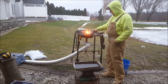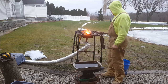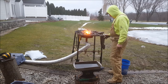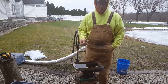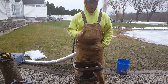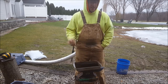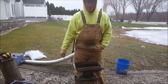I've got a magnet here on my forge — everything sticks to it. I use that magnet to check if the blade is up to critical temperature; I'll take and stick the edge on it to test. Also, I've heard from a lot of blade makers that you always quench your knife in a north-to-south orientation — makes it so it doesn't warp. I guess it's a superstition of sorts, but I still quench it north to south.